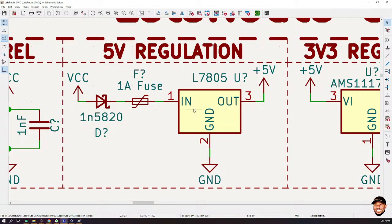So let's say you have connected 20 of the pins, and you are drawing 20 milliamps from all of them. So 20 times 20 milliamps would be 400 milliamps total. That is the total amount of current the Arduino board can deliver to external systems. Now, the microcontroller itself is pico power. It doesn't draw that much, but let's even give the microcontroller 50 milliamps. Let's give the rest of the components even 100. That will give us a total of 550.